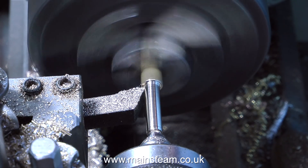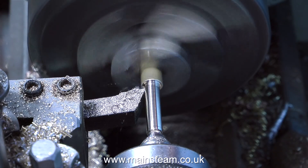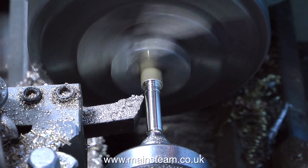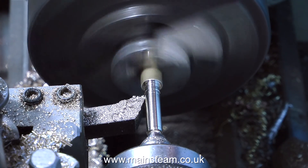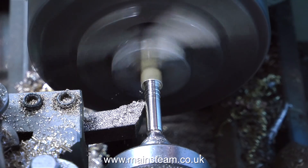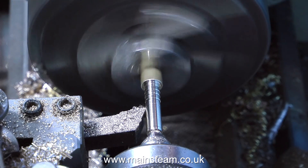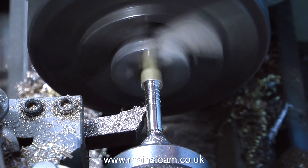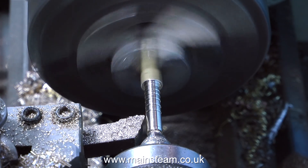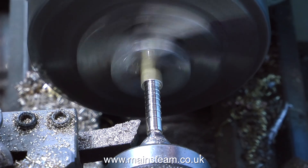At the moment I'm cleaning up the hexagon end of the bar. What I thought I would do next is create some grooves in the brass. These grooves serve no other purpose than to hold the pipe in place, but silicone rubber pipe is fine on a plain shaft, especially as I'm using butane and not propane to fire the boiler. Butane is a very low pressure gas and it's okay even without a regulator. If you decide to use propane for firing your boilers — which I don't recommend — you need a regulator because propane in the tank is at a very high pressure. For firing my steam plants I normally use a camping gas cylinder — and that's not a mispronunciation, it's spelled G-A-Z.